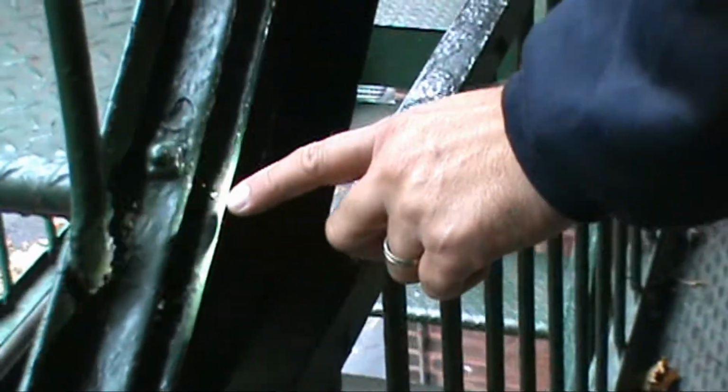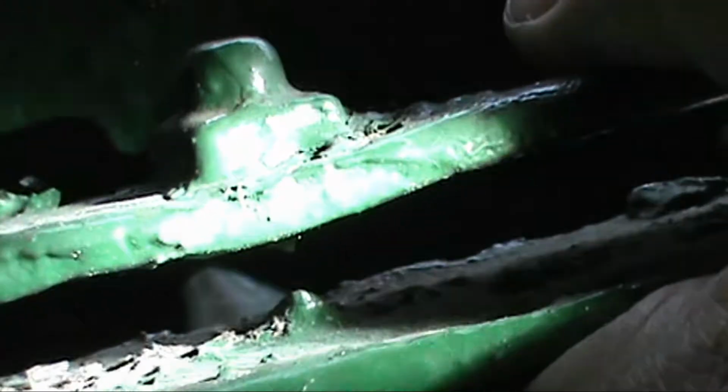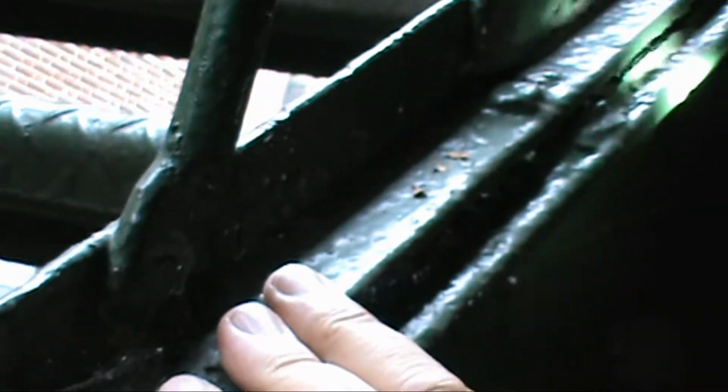As we go down, it gets worse. You know, the steel is a lot more eaten. This right here is a great example of just what we need. Look, see the bolt and the nut here? Look at my finger. Nothing in there. See it? There's nothing there. And look on the other side. There's the head. So come down and look at this way. Yep, that's it. Okay? So all of these need to be rebolted everywhere. Okay? Look at all the rust in here. And then when you do this, it's highly recommended that you silicone shut these rails.